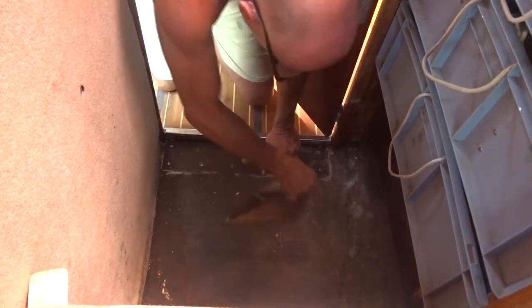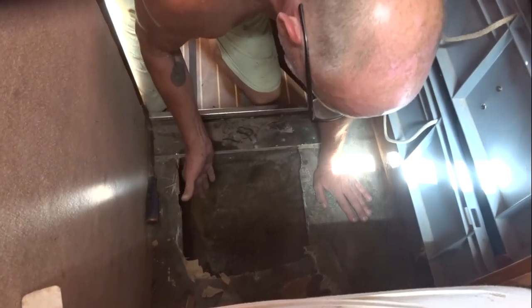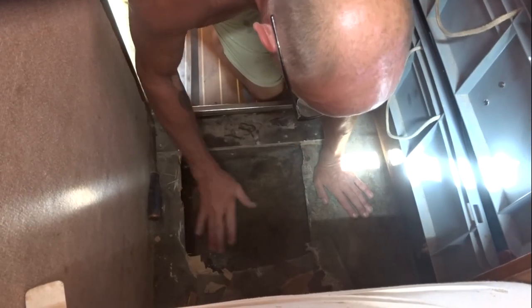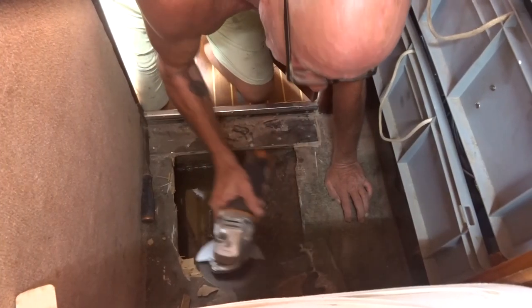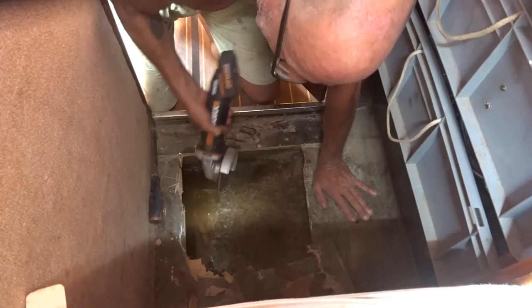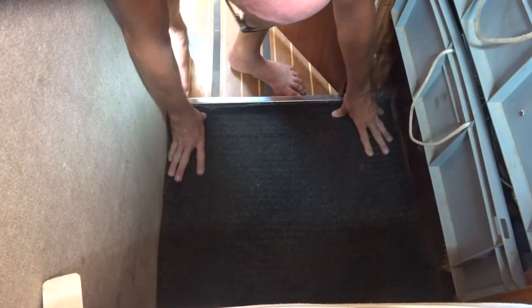There was something else I needed to address: the floor in the starboard aft cabin. There's rotten wood — water has been getting in here and I've always felt it kind of soft ever since I bought the boat. This was obviously repaired before and it's not very solid. I'm going to patch this up with a piece of wood, just temporarily, dry it out. I should fiberglass it correctly, but then I can't get in here if there's water to be removed. I think it's coming from the tank — when I overfill it, it spills into these bilges. I just have to be careful not to overfill that tank.